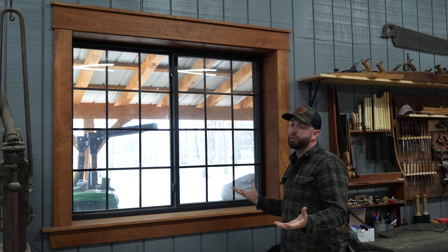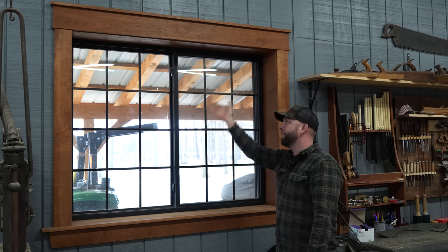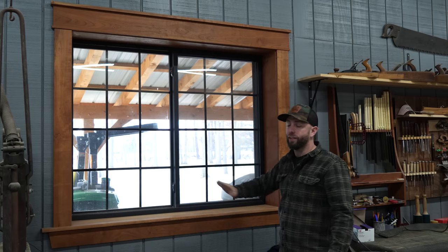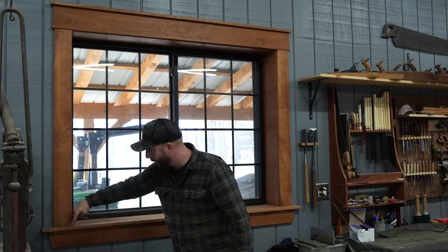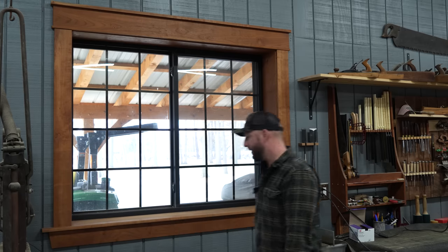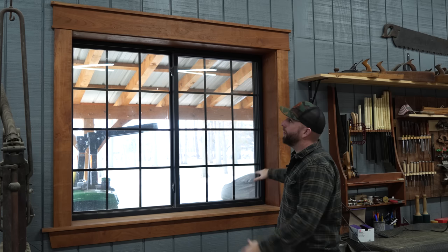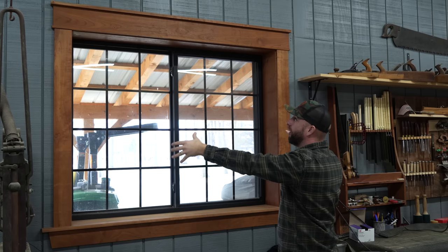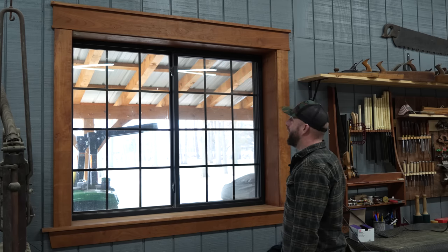Now, in a lot of new construction homes where they're just doing mitered edges, you would just call pretty much everything on the inside the jamb or jamb extensions, and all the face pieces the casings. Also on the outside edges of the stools, these are called the horns, these little pieces that extend past that your side casings sit on top of. So we're gonna build these over on a table and then I'm gonna bring almost the entire assembly and install it all at once except for the head casing assembly. We'll put that on at the end.